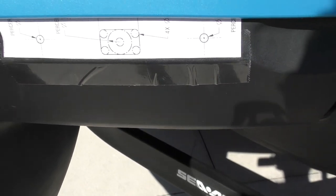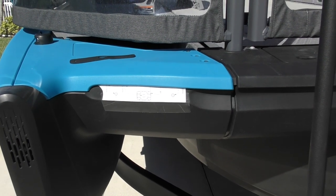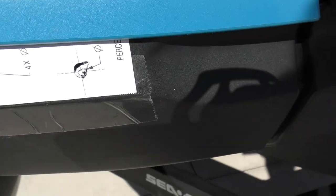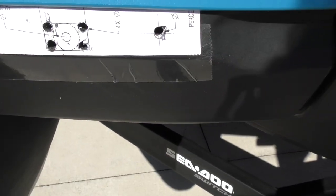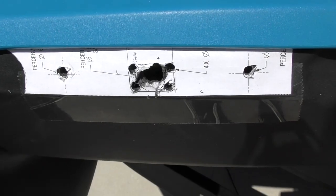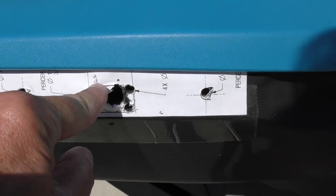Once I have that, I'll go ahead and drill my holes. Stand back and look at it — make sure everything looks good. Remember: measure twice, drill once. Six holes are quarter-inch, so you're going to drill quarter-inch holes. It drills through this material really easily, but be sure to apply pressure to your drill to keep it from spinning out in a different direction. The center hole is three-quarters. You're going to need a Dremel to cut the rest of this out.